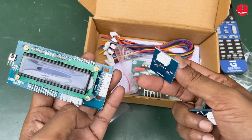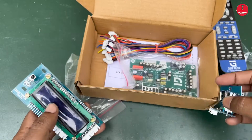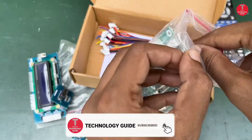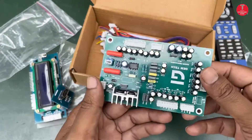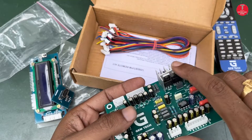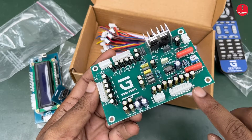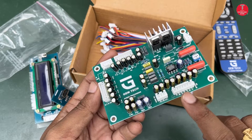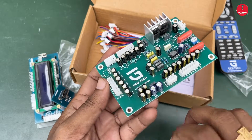The second one is USB — we can play audio files only, stereo only. This is a motherboard for 5.1 audio channel. These two ICs are regulator ICs for fixed voltage — 9 volts and 5 volts. These are stereo inputs for left and right channels for different inputs. This USB input left and right should be connected